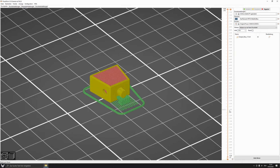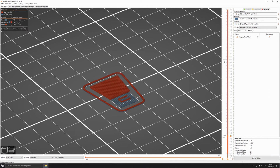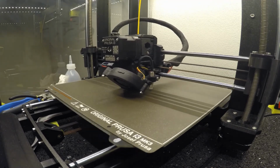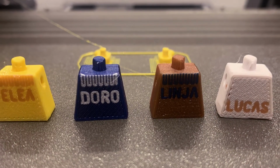Slice the 3D print and add a filament change at the second layer. The molten filament is filling the free space of the first layer automatically, and you will get a smooth integrated text. I made this really often with great results.